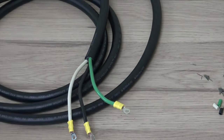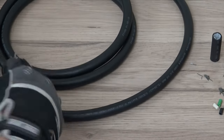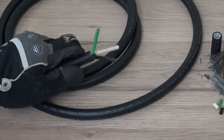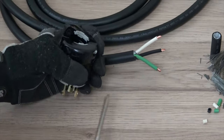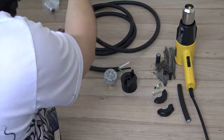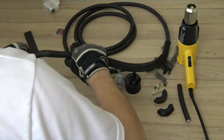After the pots were ready, I started to work on finishing the heating elements. First, I stripped the 300 volt 10-3 wire and added the terminals. Then I prepped the three prong twist lock plug for attaching the wire. Before I attached the wire, I put on the expandable braided sleeving and used heat shrink on both ends of the wire. I then attached the wire to the heating element and the twist lock plug.